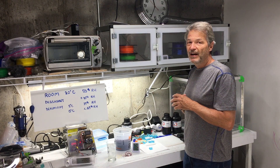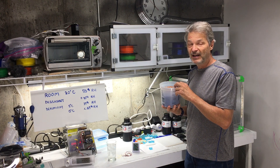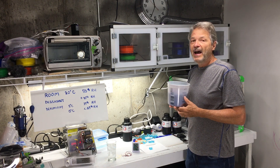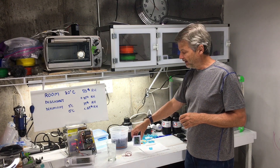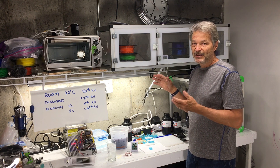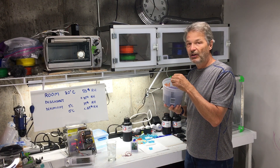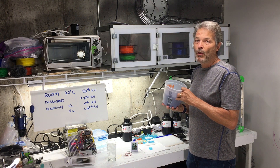One of the most common ways people remove humidity from 3D printer boxes is to use a desiccant like silica gel. Here's about a kilogram of silica gel desiccant — this is the material you frequently see in packages you get in the mail. Once dried out in an oven it will absorb humidity from the air for a while. I put a kilogram in the cabinet and discovered that in my lab environment, which typically sits around 50 to 60 percent humidity, the silica gel could lower the humidity about 10 percent — say from 55 to 45 percent — which is an important reduction but not as much as I'd like. Furthermore, this desiccant gets full of moisture and changes color from blue to pink, and I was having to regenerate it in an oven every week or so, which was more work than I wanted.